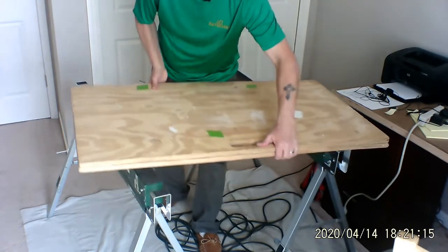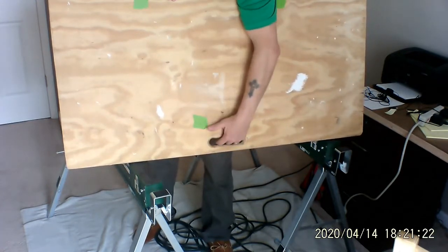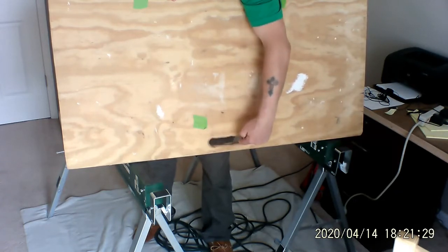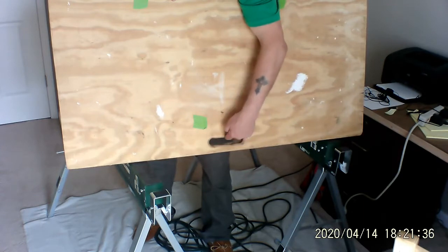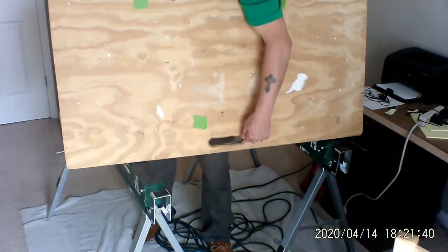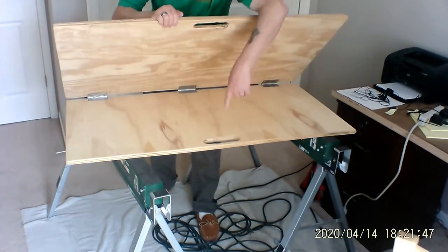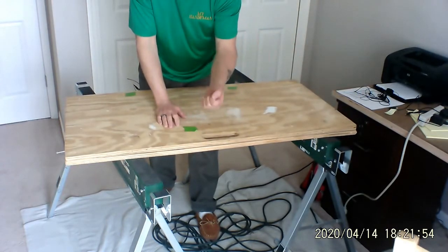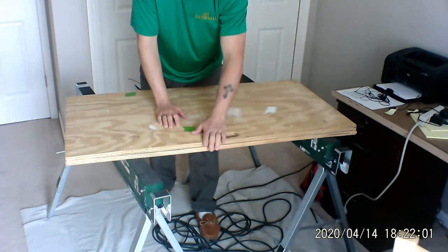What I did here — you can see right here — I built a handle. I drilled a one-and-a-half-inch hole here and another one here, and used my jigsaw to cut out this piece. Then I routered it smooth here, on the other side, and around both edges, so when I'm picking it up I'm not getting sharp edges of the wood on me.